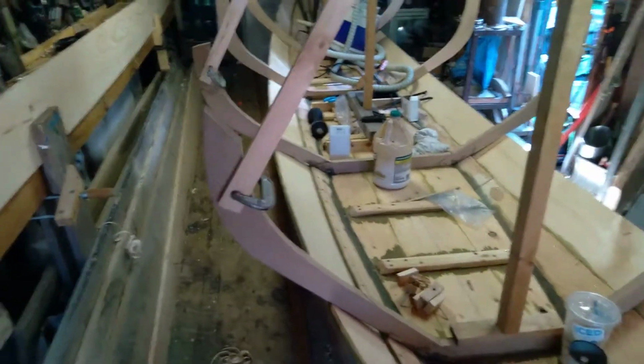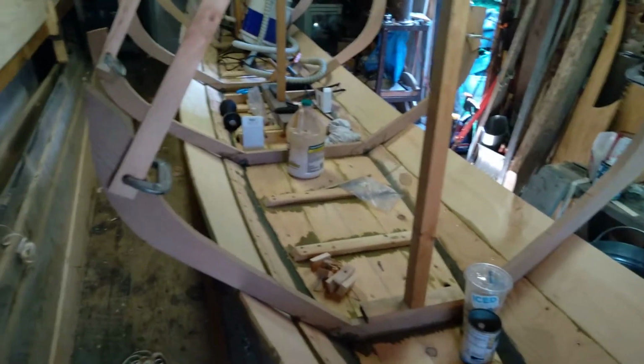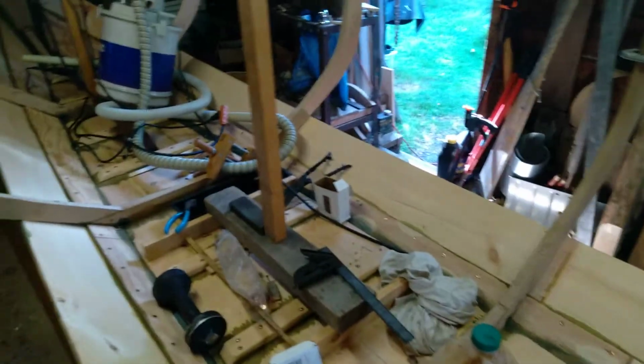Now it's not to that degree because they do have dimensionality to their boards. They're not just laying on strips. You can get even more flex out of a strip, but that's what edge setting is. It's bending the board like you'd flex a strip plank down onto the strip plank that was on before it. That's what these guys are doing.